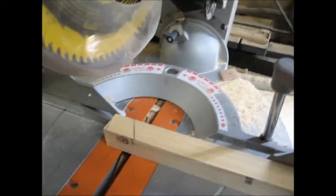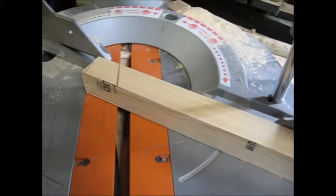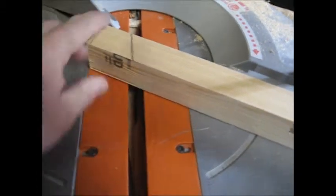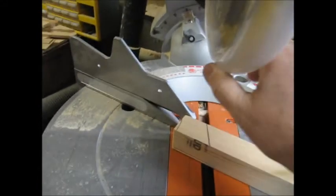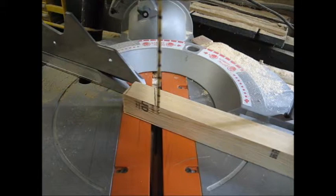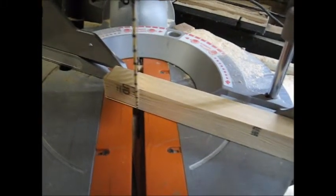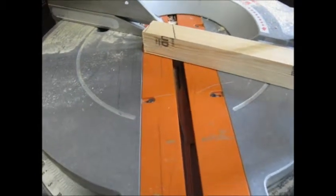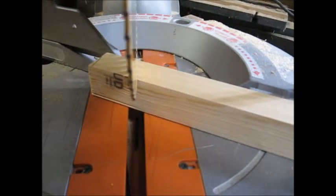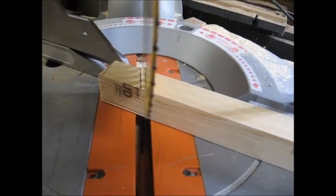Let's see if I can do this one handed. What I have to do is loosen up my table and spin this around. I can kind of get a rough idea because this slot is pretty much straight with the blade, so I just kind of get that in close. Then I raise the guard up and you can kind of eyeball right down the blade until you can get that just right. So I've got to go just a little bit more this way. That looks pretty dang good right there, so we'll go ahead and cut that off.